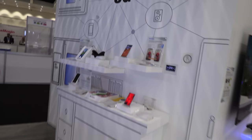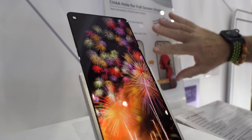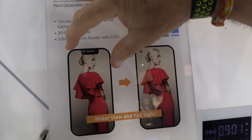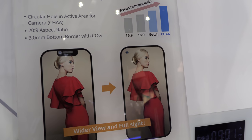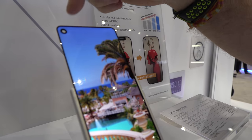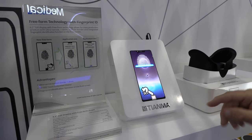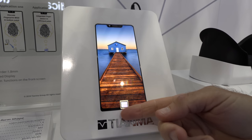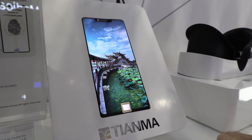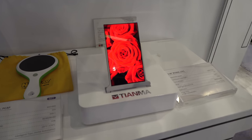You have some hole displays here. As you can see in the graphic in the background, the problem with the notch is it actually intrudes into the actual visual image itself — a lot of people don't like that. There is a way to pattern the OLED display to provide an opening, which would be used for a camera module. Very similar but in this particular case we have a cutout for fingerprint sensing, providing a fingerprint sensor as a combination of not only display but sensing.